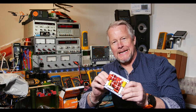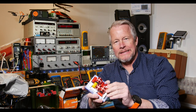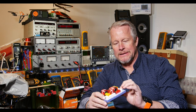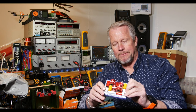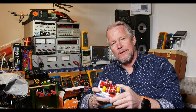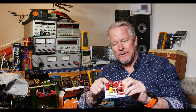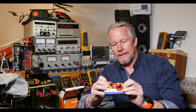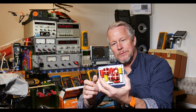I was impressed from the photographs — poly caps and nice looking inductors, and for a three-way crossover it has a fair number of parts. I'm always kind of wondering about resistors and how much power you're just losing in them, but they do provide dampening. Three-way crossovers are not easy to design flat. As for price, I think this was around $48 on Amazon — I'll put the link down below, and remember that link helps the channel.